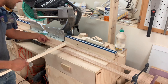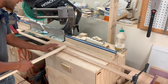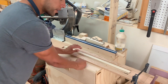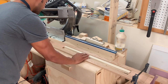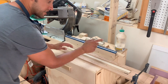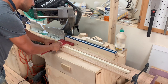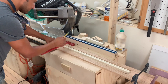From the bottom, about a quarter of the way up the pilaster, there is another block in the middle, and it is 27 inches up from the top of the bottom block to the bottom of this block. Kind of like a story stick, I cut a piece of scrap to 27 inches so I can put that in there, butt it up against the piece, and clamp it in place so it stays flush — even with the dominoes in there it's not going to move. I'm going to butt the middle piece up to it. When I make my lines, not only will it be exactly where I want it, but when I make the second pilaster, the face position will be in exactly the same spot just by using that same story stick. I'm just going to mark it out where I want the dominoes.